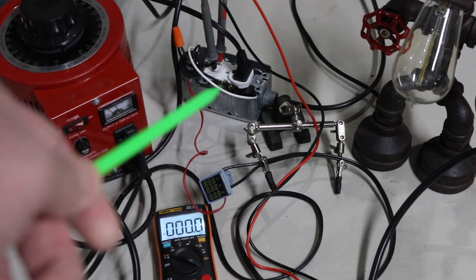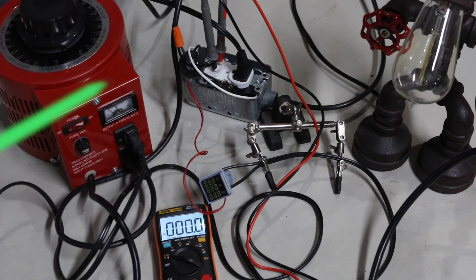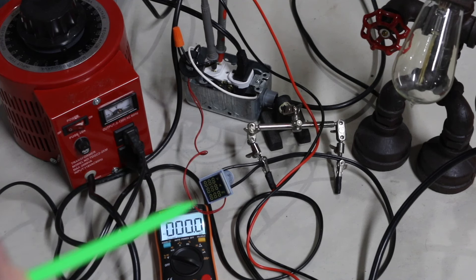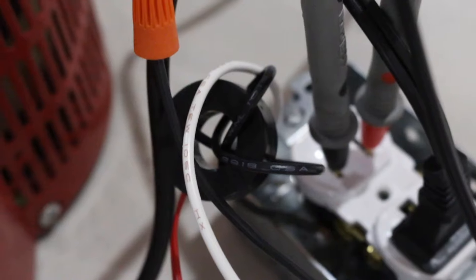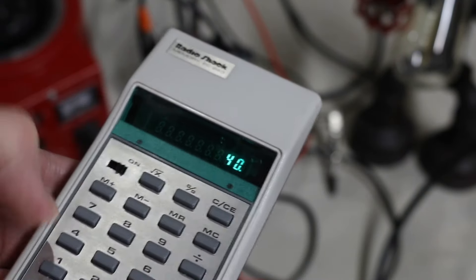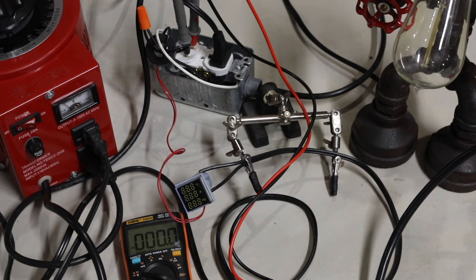Coming to this junction, I should see the same voltage on this meter, and the light bulb should change its brightness as voltage changes. It takes at least 20 volts for this panel meter to start working, and the meter itself gets powered from AC so it's a little dim at first. The current transformer cable is plugged in, and the AC powering the light bulb is looped through it three times. Using the calculator: 40 watts divided by 120 volts is 333 milliamps. Triple that and we get about 1 amp. With 3 loops through the current transformer, we should see 1 amp when we get up to 120 volts.